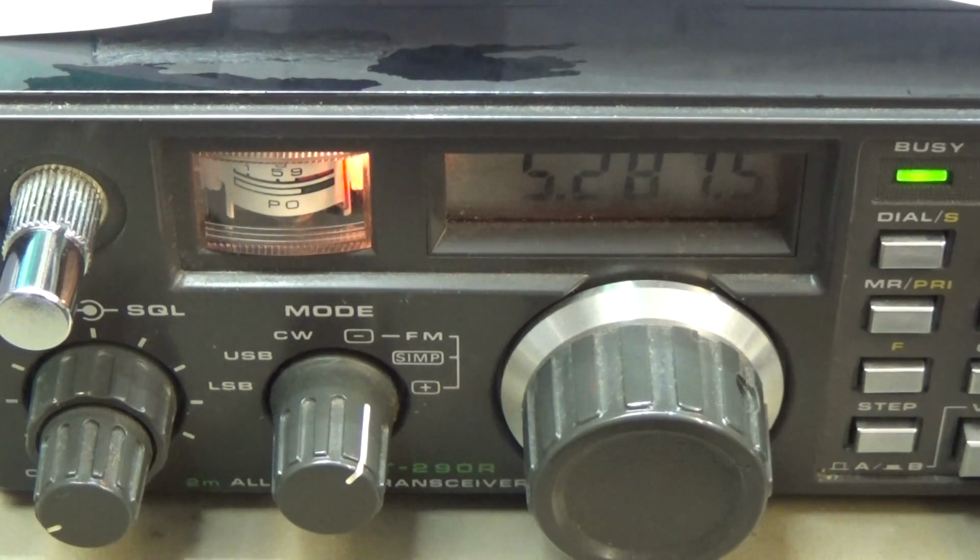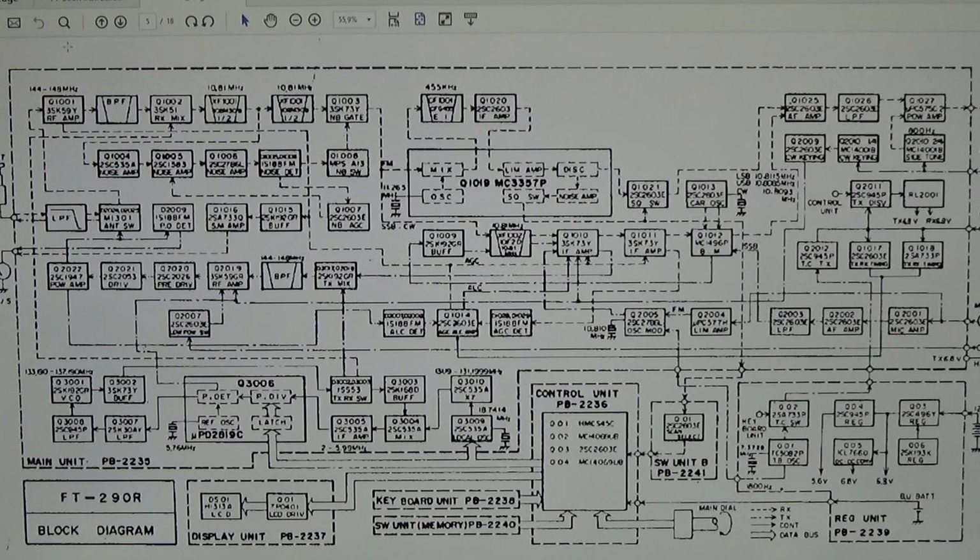So what we really need to check is if all the different frequencies are available. In this case, both frequencies from the voltage controlled oscillator and from our fixed oscillator, and of course we need to check our ALC, if there is all in the right order, and that might be a good starting point. Okay, and so that you know a little more about what I'm talking about.